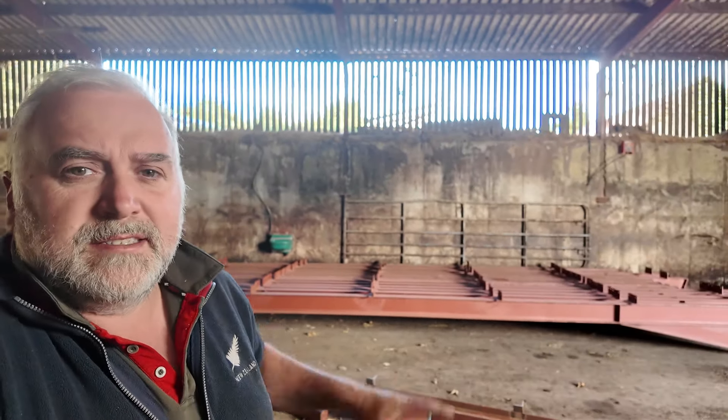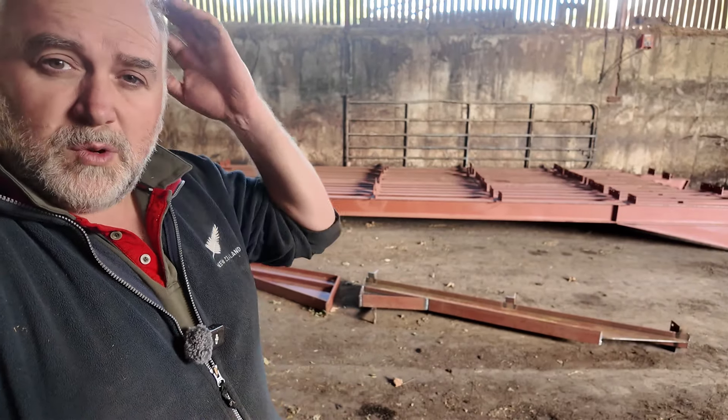I've one overhang done - they're all cut to length, just need to notch out the bottom piece and get a knee brace into it. I still have to put a couple of diagonal braces in on the feeding passage side - forgot about them when I had the welder, but it's easy enough to add cleats now. Once that's done, we'll get the pillars and overhangs all washed and sprayed. Thanks to everyone who's subscribed, and if you haven't already, hit the subscribe, like, and notification buttons. See you in the next one!